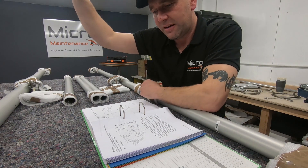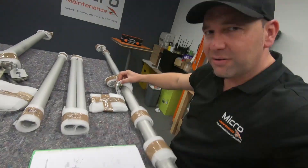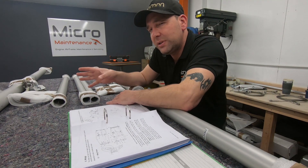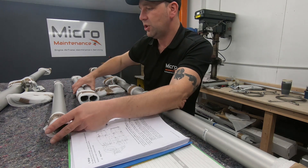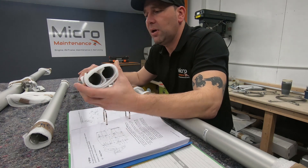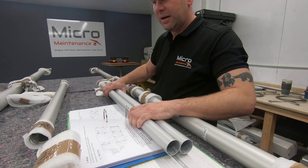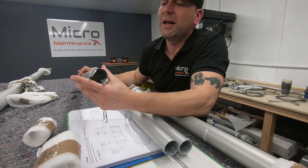I've identified the tubes. We have SKR 49 and SKR 50. Most of the bolts have already come through in the correct orientation, which is great as it gives you a good indicator of how things should be — but always compare to the manual because we all have the odd bad day. We're looking specifically for these tubes — the braces of the ladder — the strengthening between the leading edge and the trailing edge. The round ones are SKR 37: two tubes that look to be the same length and the same fitting.